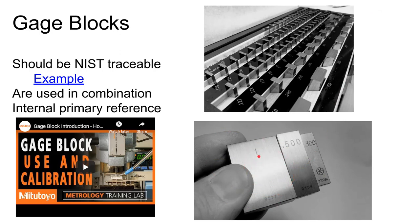How do you know a gauge block's inch is really an inch? If you just measured it with a cheap micrometer, you'd have no way to say how close it is to the United States standard inch. To make gauge blocks whose inch agrees with everybody else's, you need a NIST-traceable system.